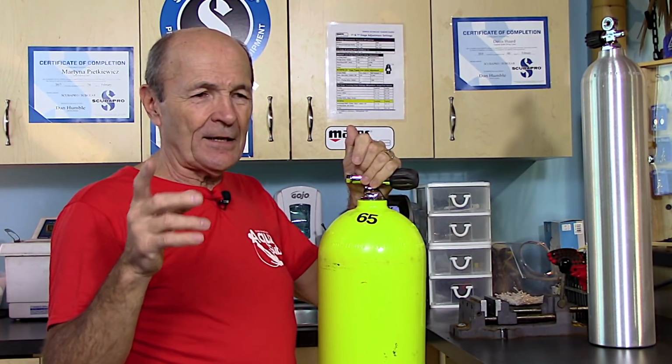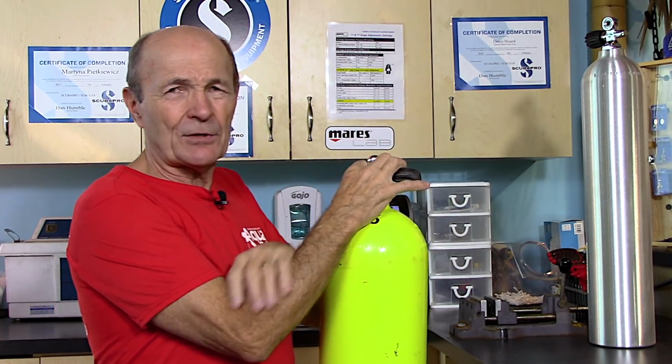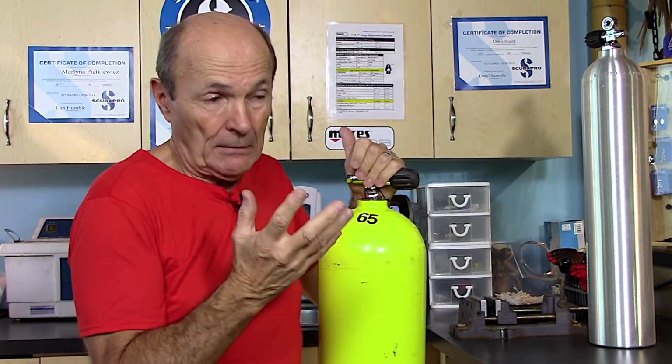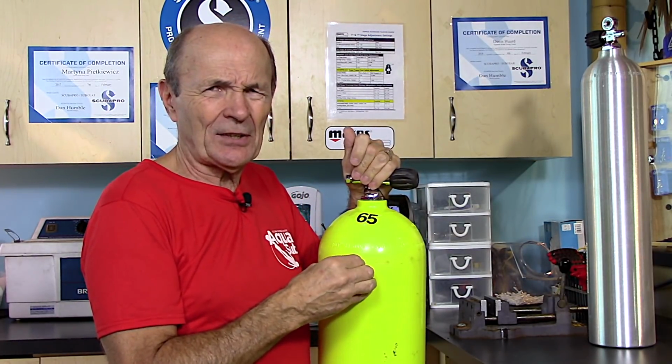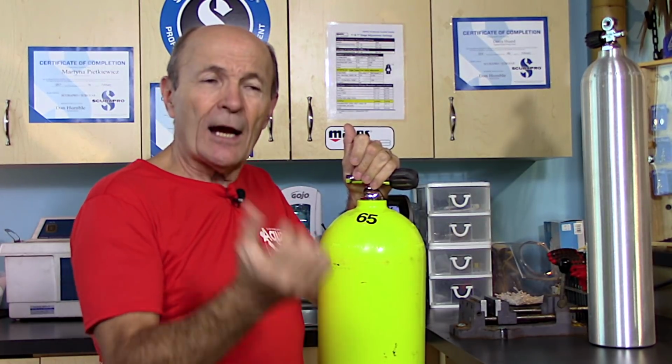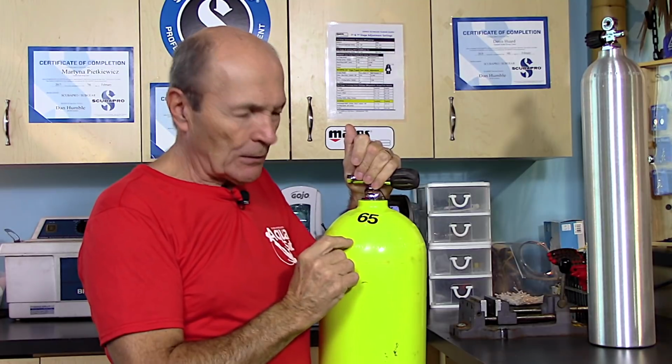Anyway, however, one of the divers in there mentioned that what his local dive store does is they overfill the tanks. Yeah, they fill the tanks to, what did he say, 3,500 PSI, you see? And then when they cool down, it comes out close to 3,000.